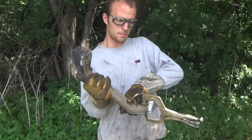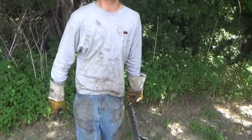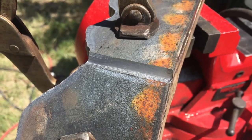That left me with the problem of needing to bend the corners on it — and that area isn't really that strong. So what I did is I took an angle grinder with a cutoff disc and scored almost all the way through the material, leaving probably about an eighth inch to a sixteenth inch. The more you take off, the less work it is to bend it.